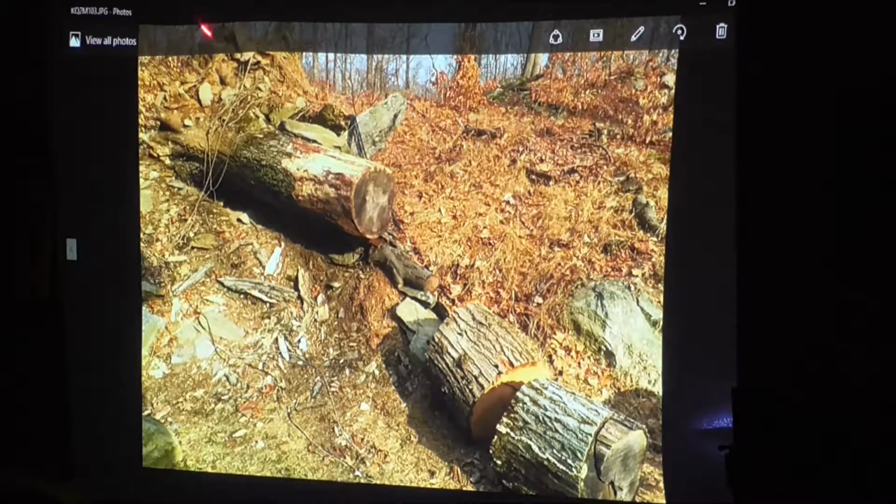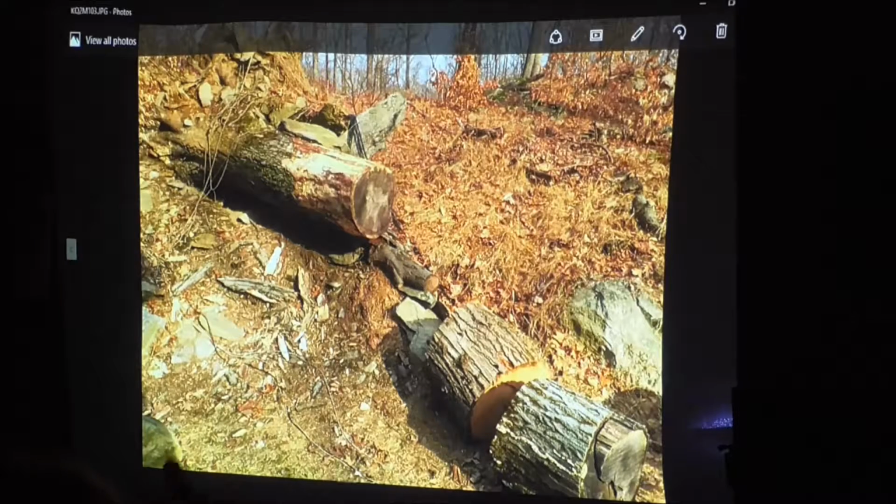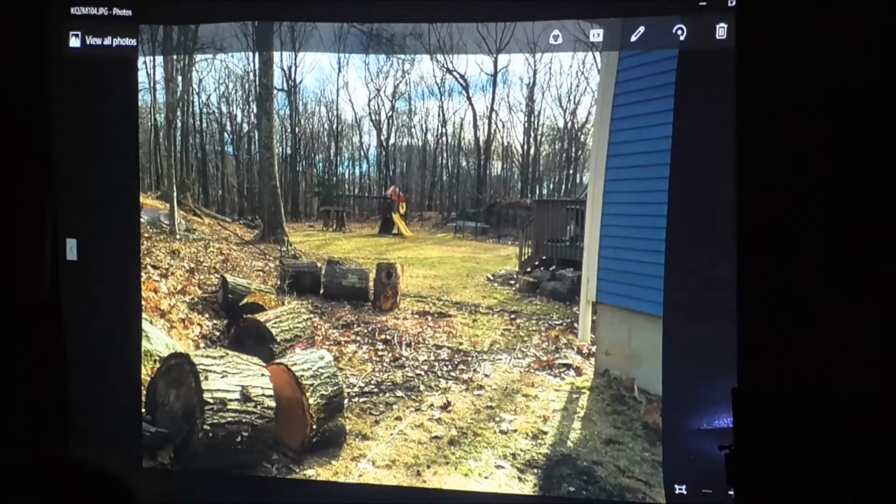So if you see my towers up here on the ledge, everything had to be dragged up the ledge and moved around the ledge. The reason we couldn't get any equipment in here to do any work, except a tiny backhoe. Even for the concrete, we had to have the concrete truck drive to the base of this, and then the backhoe had to dip into the concrete, take it over to the tower base, and pour it in. It was quite an undertaking.